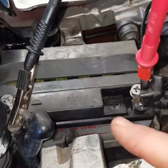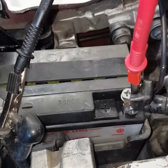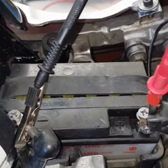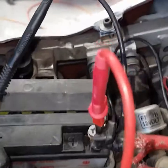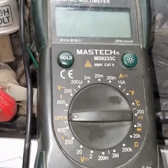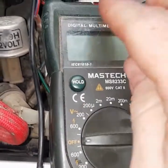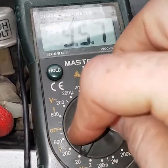What we're going to do is test the voltage across the battery. I've connected the positive pin to the positive terminal, the negative pin to the negative terminal, and held them in place with some basic alligator clips that I bought from JB Hi-Fi. This is the multimeter we're going to use. We're going to switch it to DC voltage — we want to make sure that it's DC, not AC.